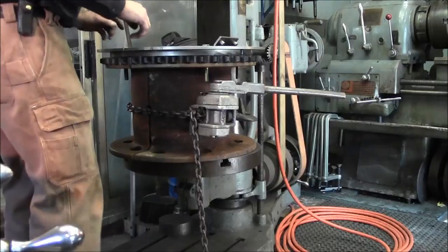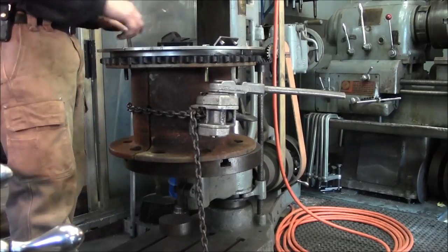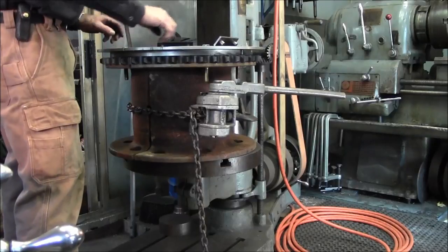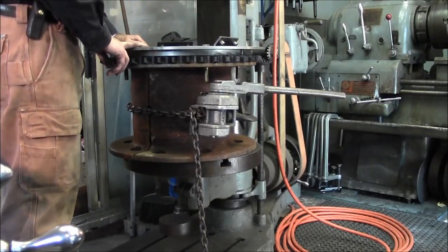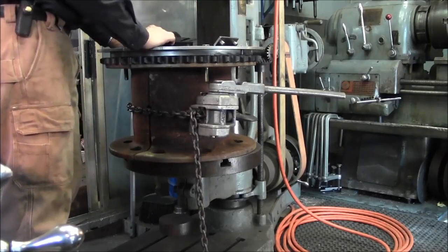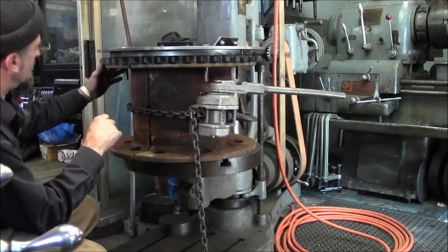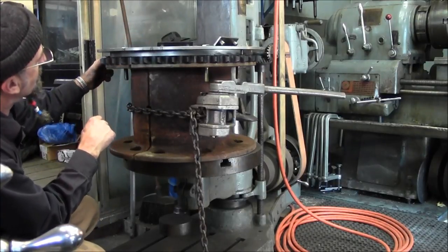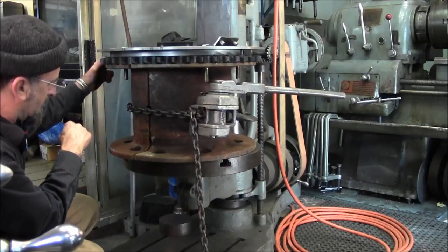And we're going to cut some 5/8 rod now. We're going to go ahead and see if we can drive the 5/8 rod down in here. We're going to tighten up these four bolts and then run a reamer so we make sure that all of these are exactly the same. And we really like to tighten that up if we can a little bit.